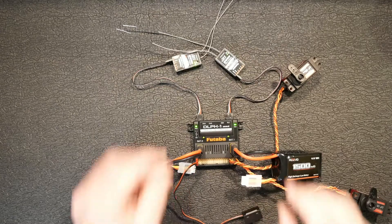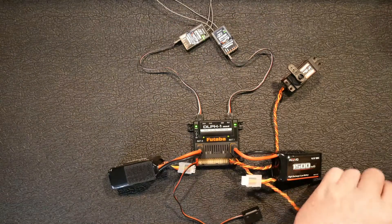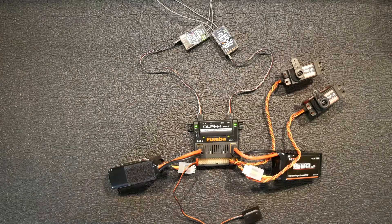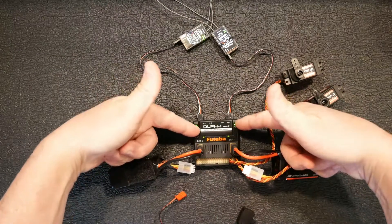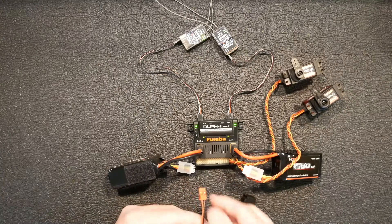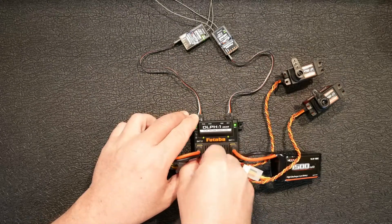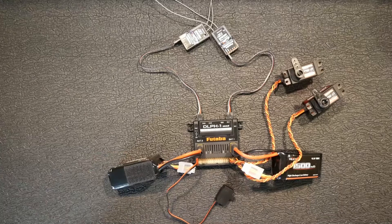I've got my radio turned on, so I'll turn on the unit — we get two green lights on our receivers and our servos are working. Let's say I had a failure — I'll simulate it by pulling out this switch. I'm disconnected, but I've still got two green lights and everything still works. So you don't have to worry about this switch failing and causing you to crash an airplane. I'll plug it back in — no drama, nothing happened. Turn it off and everything goes back off. That's what a soft switch is.